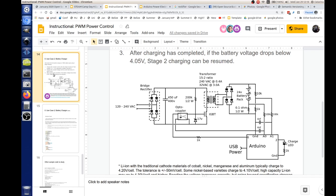Yeah, because for the Pi, we want to have that configuration. We want a battery bank at like 5 volts for the Pi. So we don't want to use like 7. No, we want to use 3.7 volts in parallel if we're using multiple packs, because the Pi takes about that. You don't want to make an 18 volt pack, because then you're stepping down all the way to the bottom. But with 3.7 volts, if you put them in parallel, you're still going to get 3.7 volts. You won't get 5 volts.